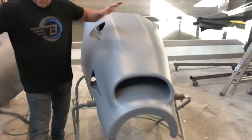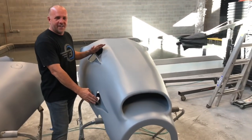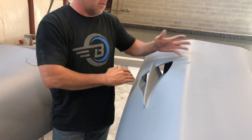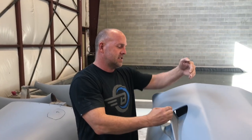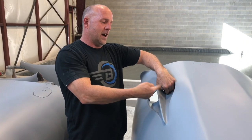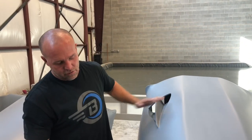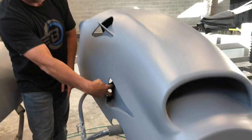Draco's coming along fast. The cowling is officially totally done and split — ready to go. I've got lots of various NACAs on here. This NACA is for the oil cooler — it's a lot deeper, longer, and wider. This fin directs the air as it comes around: it hits the side and gets directed in, and the air that skips over the top loops back underneath and goes in the second side. This really works well for an oil cooler.